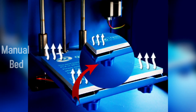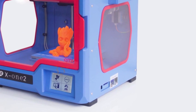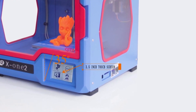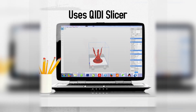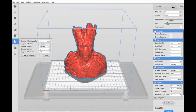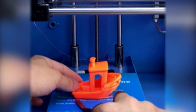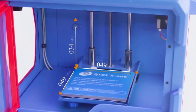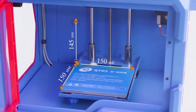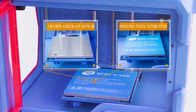The bed is manually adjusted on the X12, but it comes with a direct extruder so it supports ABS, PLA, TPU, and most filaments. It even comes with a touchscreen, which is hard to find at this price range. Kidi has its own slicer which simplifies things but limits flexibility. Customer support answers within 12 hours, and they even include a repair kit and a removal tool. The main downside is a smaller print size of 15 by 15 by 14.5 centimeters and it's harder to upgrade.